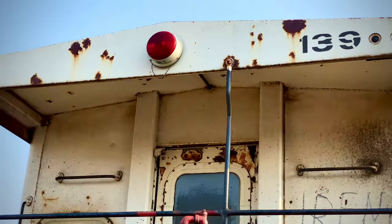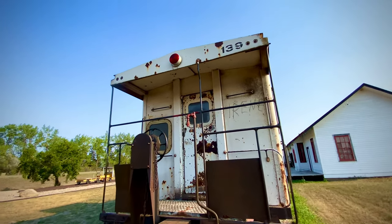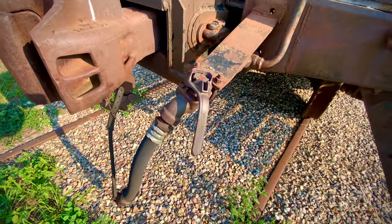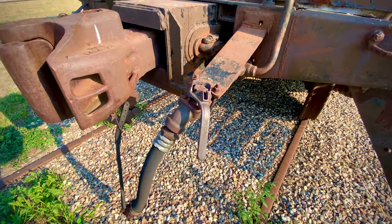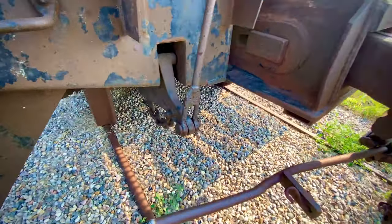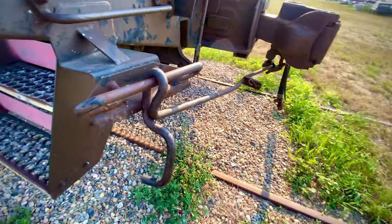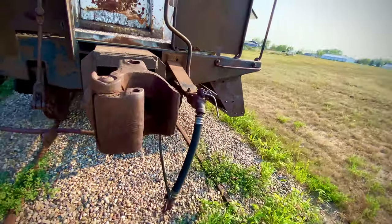It has a brake light in the rear, whichever direction it might be going. You can see the narrow door right there. It's got a coupler right here, and an angle cock — so I doubt if it has any pressure in it. You have the brake right there, and when you activate it, it pulls from that lever, then the chain becomes tight and that sets the brakes manually. And this lever right here is to release the pin when you want to separate rail cars.